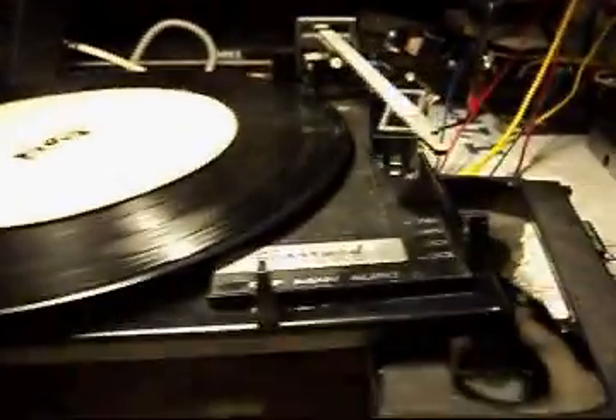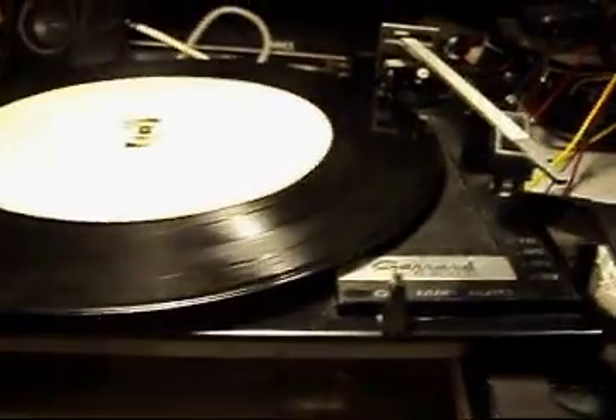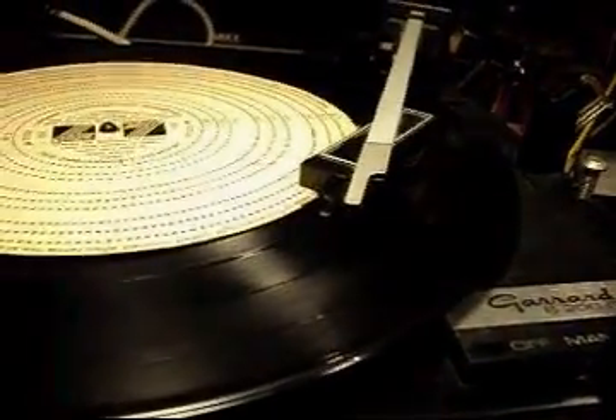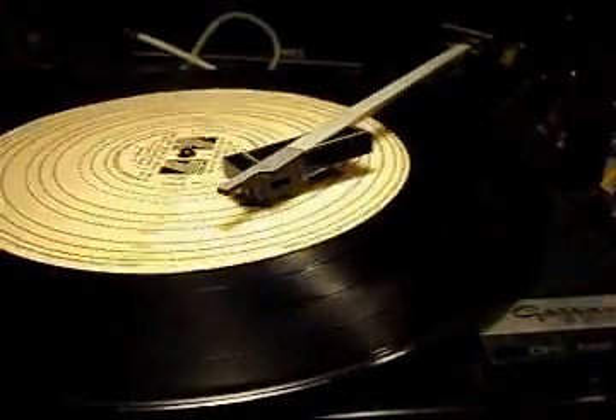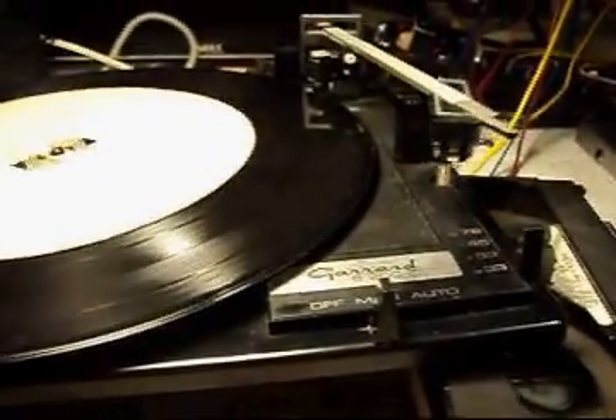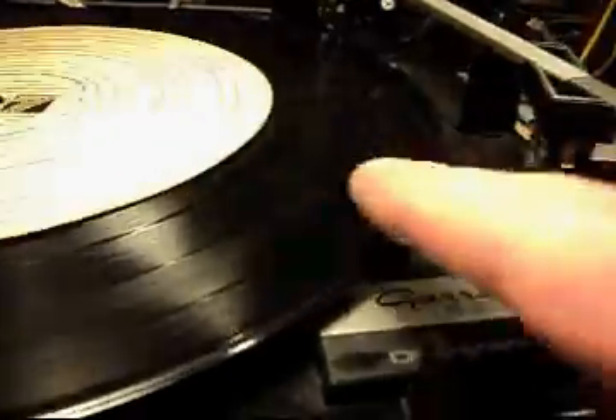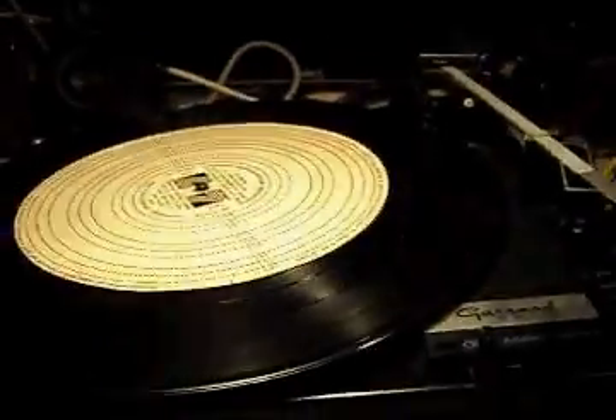Success! I sprayed a lot of WD-40, which is a rust penetrant, and loosened up a bunch of stuff. I managed to get this to work properly after cleaning the drive. We're on 33 12-inch record and as you can see, there's no needle so it's just going to slide across. I actually adjusted the needle setting — it'll just slide across and basically return and park itself. So that's all functioning properly. The 45 setting for the arm is a little off — to adjust where this sits there's a little screw right there that you adjust.